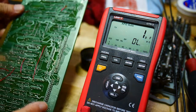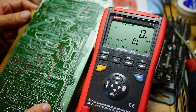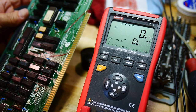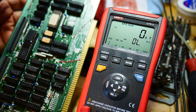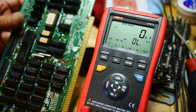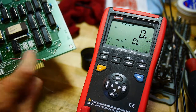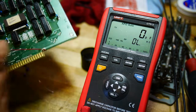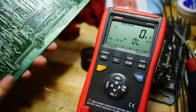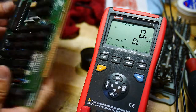The jumper wires on the back of the board are, in notation I think, from CCS — CCS2422. There's a bunch of internet postings on mods for this card. This does have the mod — there were some grounding problems, which is what this wire here fixes. There's a lot of current being drawn in some area where the trace kind of sneaked around. Anyway, this adds a shorter path for the ground. There's also an open collector drive somewhere — there are some cuts and jumps. You can find that data online, but this board has all the mods it's supposed to have.